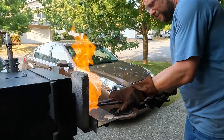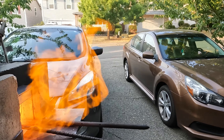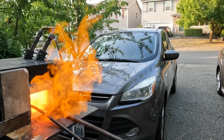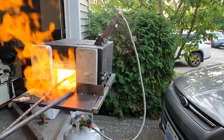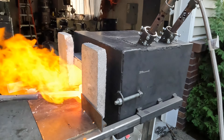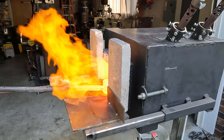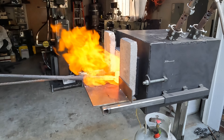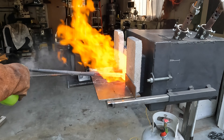I actually have three separate pieces of steel in my furnace. This is very efficient — you can work one while the other two are heating up. Instead of having your furnace run with nothing in it, always have two or three billets you can work on and forge. One can be worked on while another is heated, so you're in a constant state of rotation. It's a very efficient use of steel.